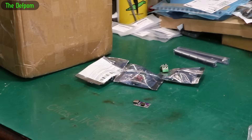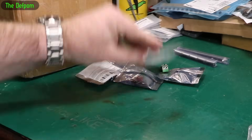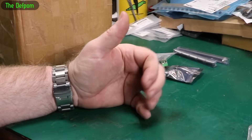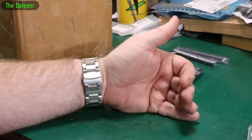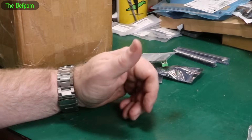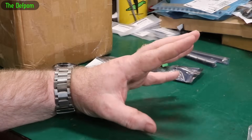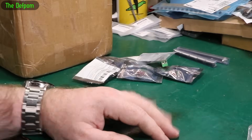I may use them for something one day — I haven't had anything like this before. But what I actually really need is something which can output power delivery where I can have a 12-volt power supply and tell it to negotiate a 12-volt power delivery over USB-C to a device. That's what I need. I've ordered some other parts which I think will do that — I guess I'll find out, but it's not these ones.